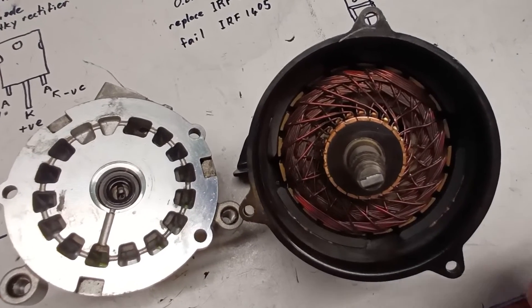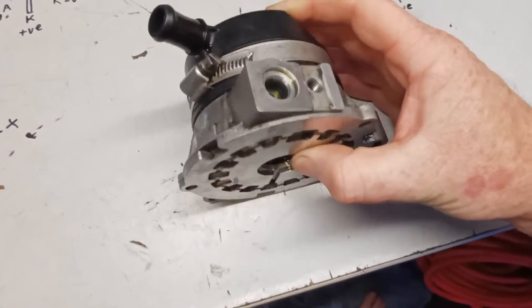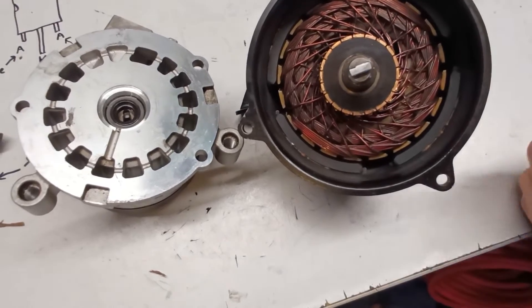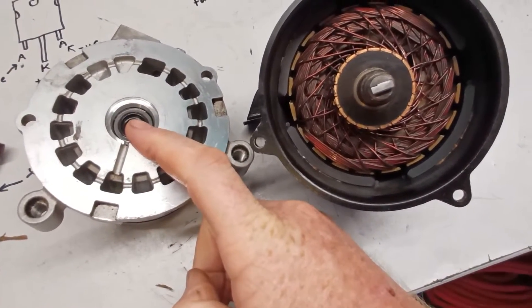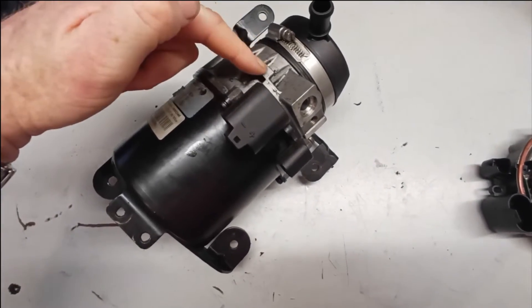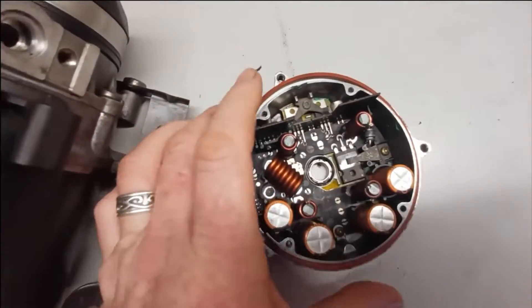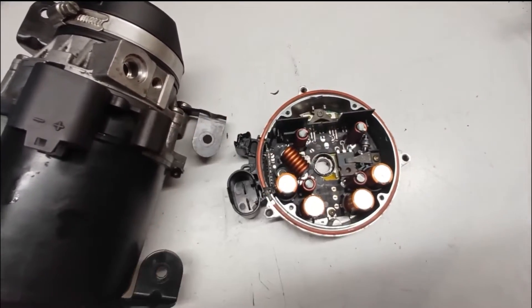It's electric hydraulic power steering. This part is your actual hydraulic pump, and it's driven by an electric motor, which is a bit different to other cars where the auxiliary belt is usually turning the pump. There's a control circuit inside, and if your pump's running on, often the problem is the two MOSFET transistors — if they blow, it can run all the time.